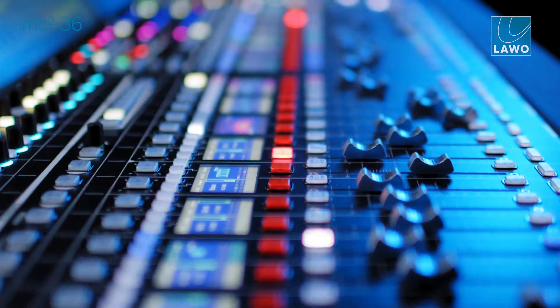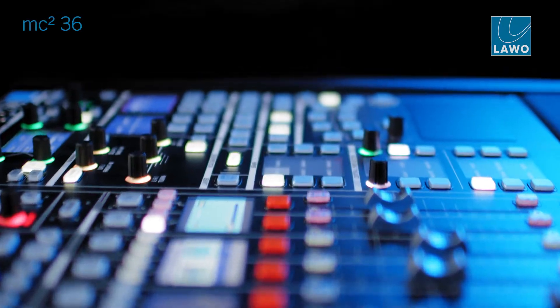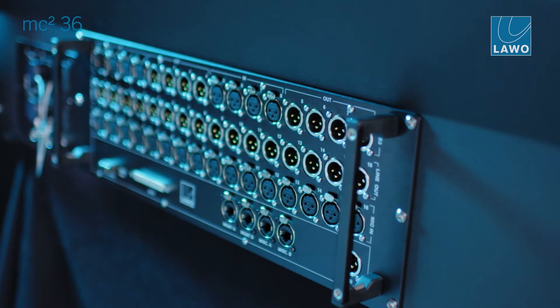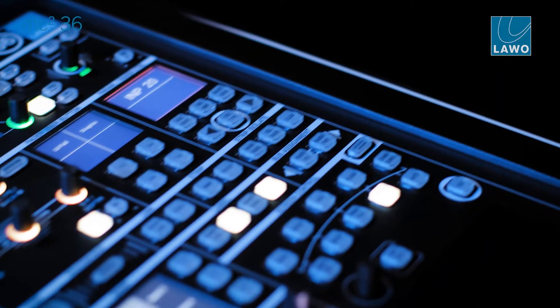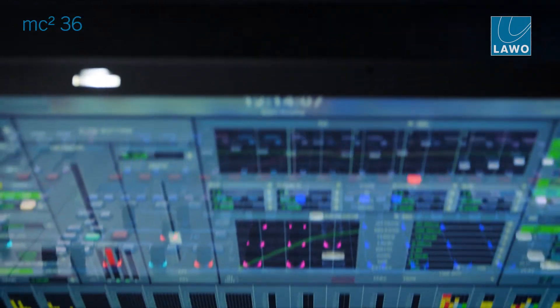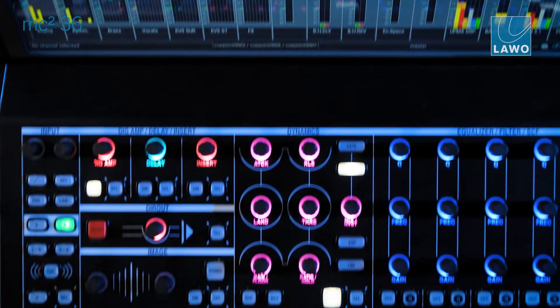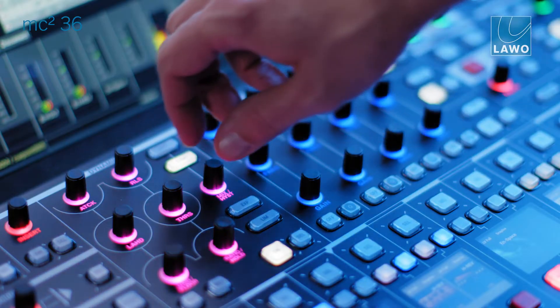At the heart, the MC236 Mark II uses the UHD core, which gives the complete console a new level of performance. We are not only providing microphone inputs and line-outs, but also some AES3 connectors and a built-in MADI port for legacy I/O connections. We increased the I/O capability by factor two and still have redundancy on top.